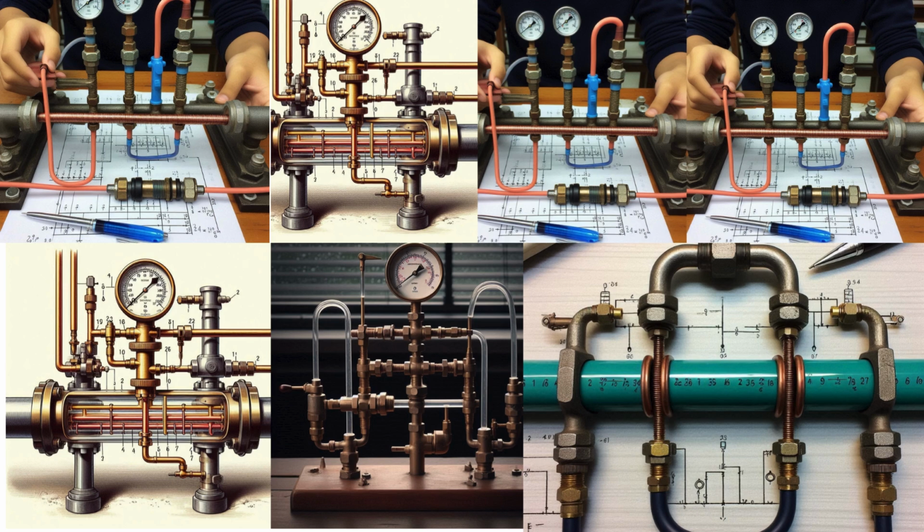3. The upper part of the inverted U-tube contains air. The water enters into the 2 limbs of the tube through the 2 sections of the pipe. The height of the water columns in the tube may be adjusted by letting the air through the valve at the top. As the air trapped in the upper part exerts equal pressure in both the limbs, the difference of pressure is equal to the difference in the height of the 2 water columns.